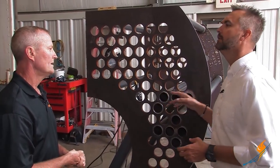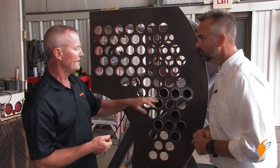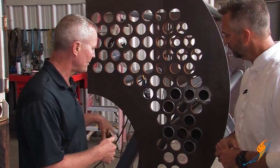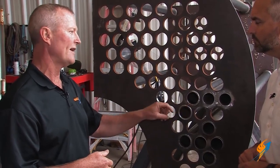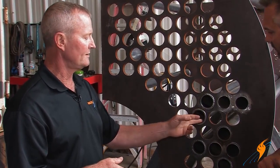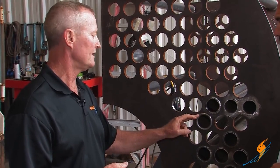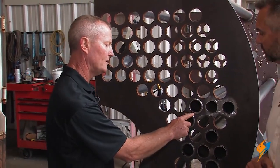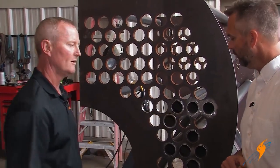Sometimes you see welding on one side and beading on the other. Typically the welding is on the hottest pass — the very end of the boiler, the first pass where it starts back through from the Morrison tube. We like to weld the hot pass, and a lot of manufacturers do — we follow their procedures. It does a better job. At 1,800–1,900 degrees, over time some tubes will start to leak. If you seal weld that, it gives you a better seal from the end of the tube to the tube sheet, and all we're doing is trying to transfer that heat.